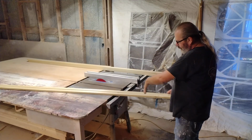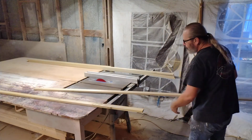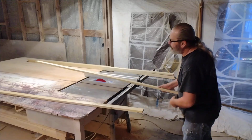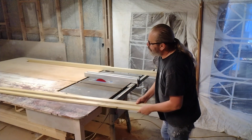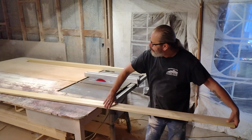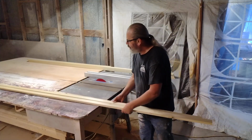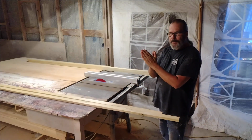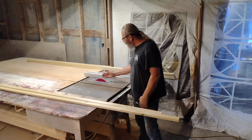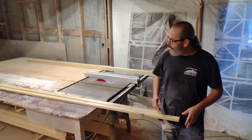It's touching at the ends and it's spread out in the middle. When you start cutting that, the first thing it does, and this is a real common thing, is where that end touches, it starts tightening up. It'll tighten up on the blade. If you go past the blade, it can tighten up on the splitter. That's the thing that gets me.